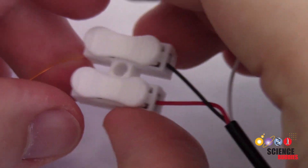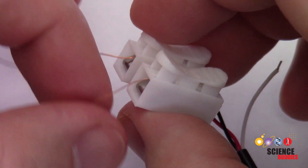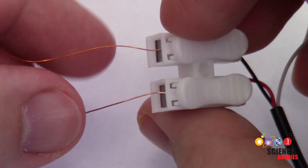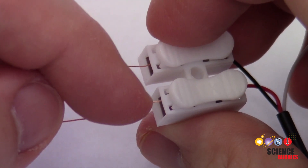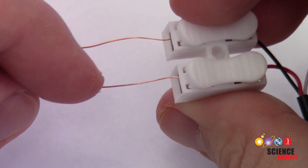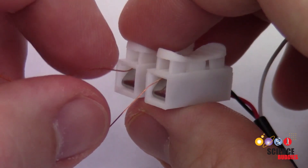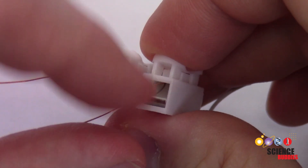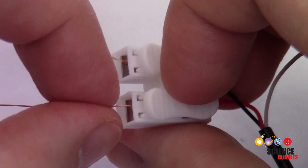You need to check your magnet wires on the other side. In the assembly video, we show you how to strip the insulation off of these magnet wires with sandpaper, and that can be kind of difficult to see. Once you have stripped the insulation off, these should be a little shinier. The insulation itself has a slightly darker, less shiny color, and the parts with the insulation removed are a little lighter and shinier. You want to make sure these are in there such that the metal tab inside is making firm contact with the part of the wire that has had the insulation removed.